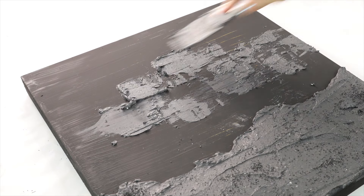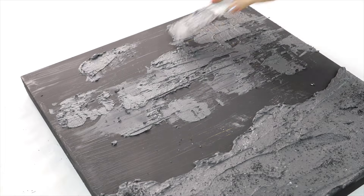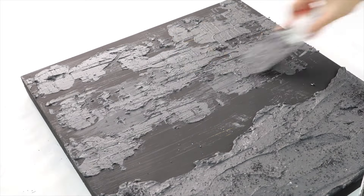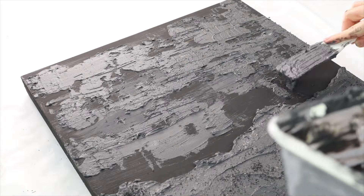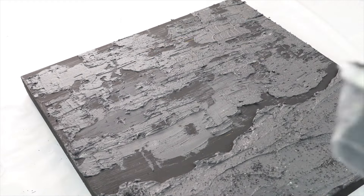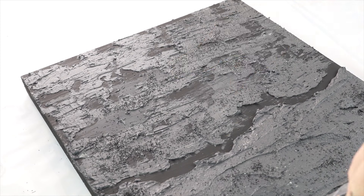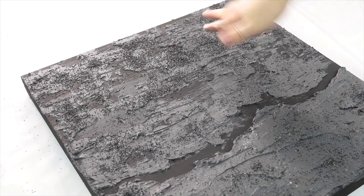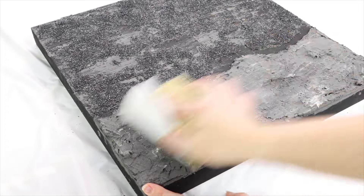I also decided I wanted to add a little bit of texture underneath where the resin will go, so you can see it coming through. I applied that to the end of the board randomly and scraped it down so it wouldn't be too thick. On top of that I also sprinkled some black sand — technically called vase decor, which I found on Amazon — all over the top because I wanted it to be a bit glittery coming through the layers of resin. I also put a little over the texture paste area, but since I'd be sanding that back anyway, you can skip that step.